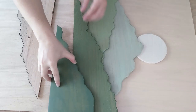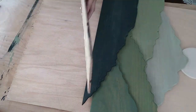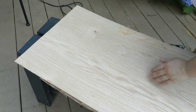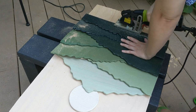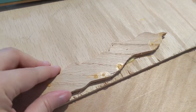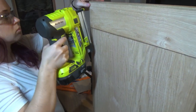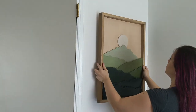Now comes the fun part — and the part where I almost ruined the entire project. As I glued and nailed on each piece layer by layer, I noticed I was going to need to cut the backing down once it was ready to be framed. For something like this it's probably better to have a table saw, because my attempts to get a clean cut through all of the layers left a few gaps that were more obvious when I tried to frame. So I wound up taking things back apart and cutting the sides piece by piece on my miter saw — a bit nerve-wracking, but I'm glad it was recoverable. Also, using scrap pieces from your scroll saw work earlier can add stability behind any of the thicker layers. I made a simple frame as a border using regular Minwax stain, then glued and nailed a few plywood strips to the back to add a little lip from which to hang the piece on the wall.